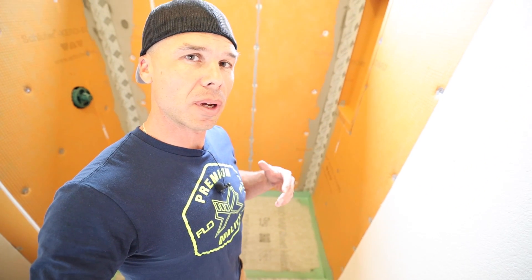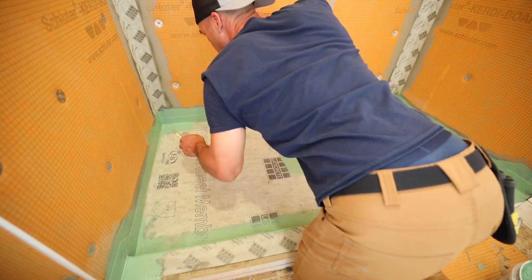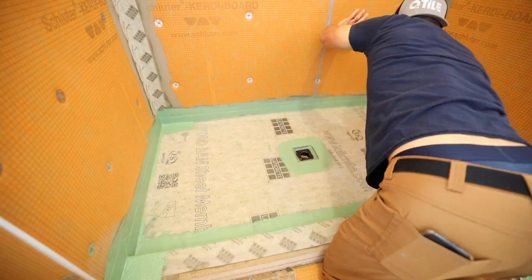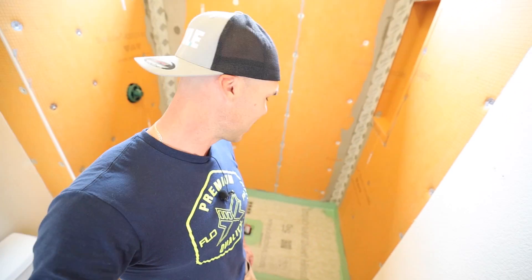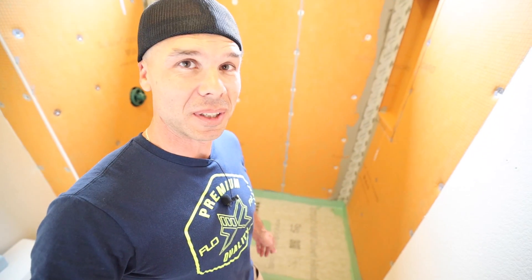At 70 degrees they want you to wait 15 minutes between each coat and 15 minutes before you flood test. So I did my first coat, waited 15 minutes, did my second coat, waited 15 minutes, and now — can you believe it — it's time to put the flood test on here. It's only been 30 minutes since we put the first coat on. Here it goes, let's fill it up with water.